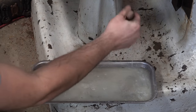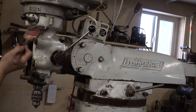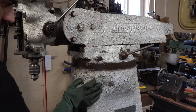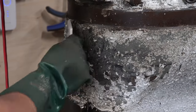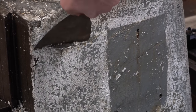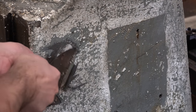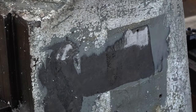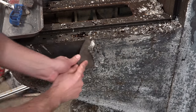I'll slap this paint stripper goop all over the mill and wait — I let it sit overnight. It doesn't dry that quickly, so that's nice. You come back the next morning and everything's flaking off. You can see how it reacts differently between the two types of paint: the external, probably latex, modern paint peels off super easily, and underneath is that grey 100% lead-filled paint, then the primer underneath that, and body filler underneath that. But it softened all of the layers enough that I could go with a metal scraper and just start scraping like crazy.